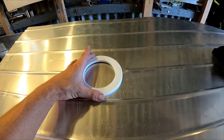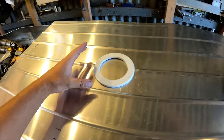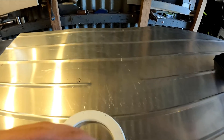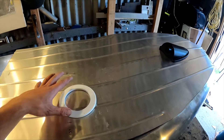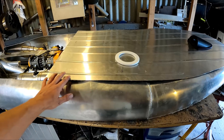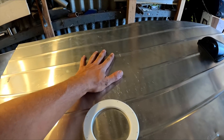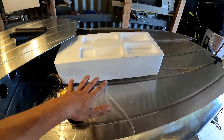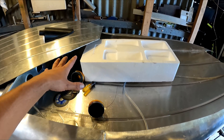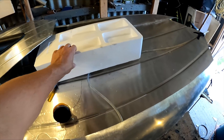In this gap here, a piece of plastic is going to come up underneath — it's got an M100 by 3 thread on it, and the other half's getting printed at the moment. That'll screw on so I can put my arm in and access various parts when I need to take it apart, because this piece is going to be siliconed and riveted down. This is 1.6 mm thick as well, so it'll take my weight a whole lot better. I've been saving these styrofoam blocks — I'll glue a few of these in here so I can stand on it and it won't crush.